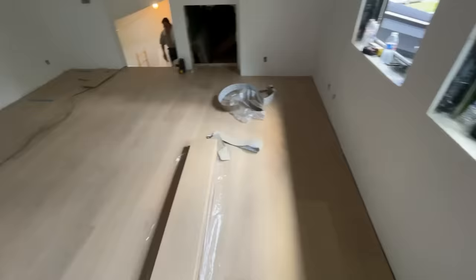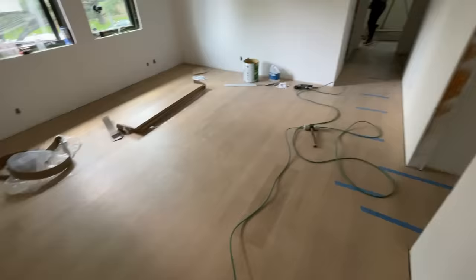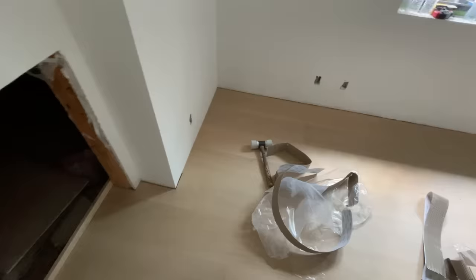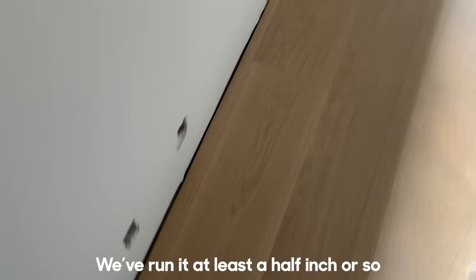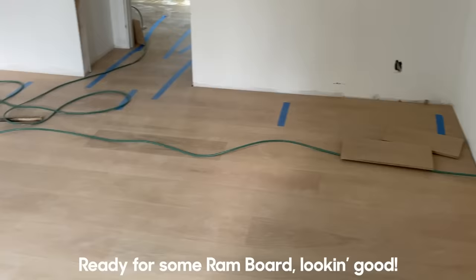The first room is done - it looks so nice! The first thing we're doing is covering it immediately with ram board. You can see some dust marks from our drywall on the feet. We didn't run it quite tight to the floor - there's a little gap in this direction - but in the width direction we've run it with at least a half inch or so down the wall to leave expansion and contraction room. That's best practice even for this incredibly stable floor.